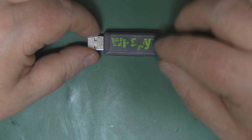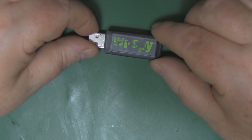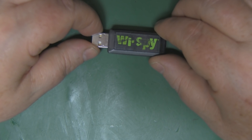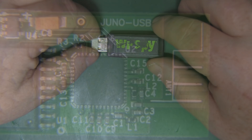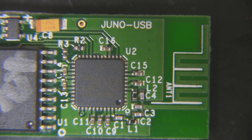This is definitely going to be a macro lens video. It would be nice to keep the original case with the SMA mod on the back, and since it's a pretty generic case, any USB stick case should fit. Here's a close-up with the macro lens - the chip we're most concerned with when modifying this is a Cypress chip, the CYW USB 6934. I'll leave a link to the datasheet in the description. This was a common chip around 2007-2008, and as soon as I opened it up I went and got the datasheet.